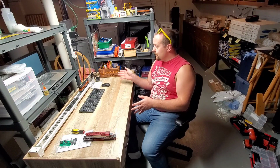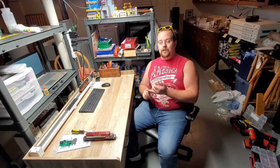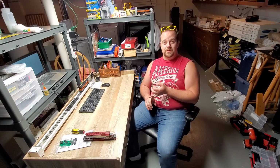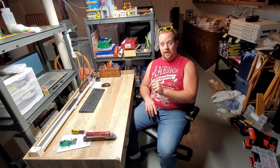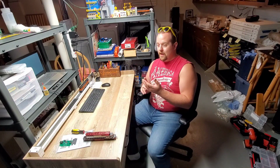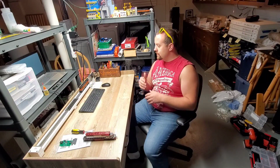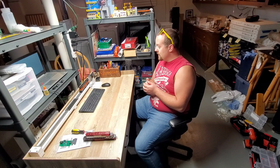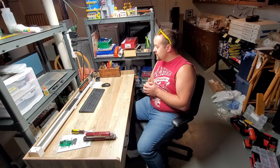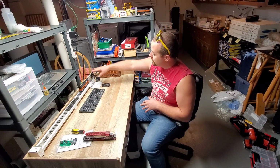As far as what you need for this, all you need is your DCC programming system that you want. You need 2 double pole, double throw switches, preferably an on, off, on, and an on, off, on. And then, by mistake, I had an on, off, on, and an on, on. Not the worst thing. I prefer to have an on, off, on, and have 2 of those. You'll need a small piece of plexiglass. Mine's about 5 by 5 inches. You can do it with 4 by 4, you can do it 4 by 6 and do it tall. It would give you a little bit more space this way.